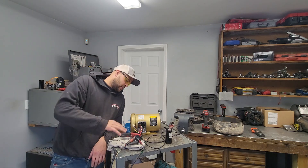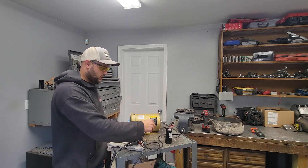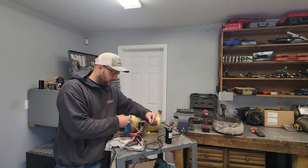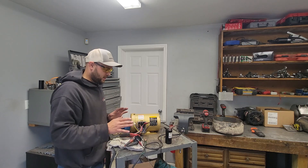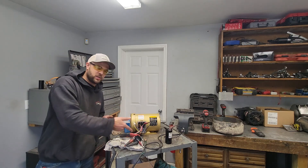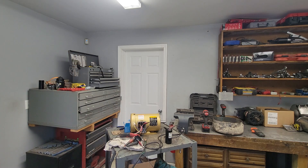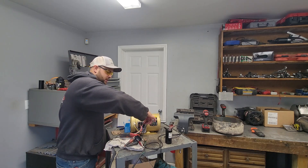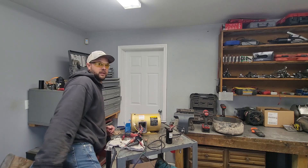Now I'm going to show you something about a phase converter. I'll leave the switch gear in place. This wire runs to the switch — it's the third leg that only gets momentary power. The other two have constant power. I'll let it start, then pull that wire off — since the switch already kicked it out, there's no ill effect. Now that third leg isn't hooked to anything.